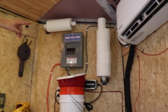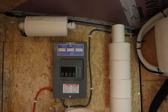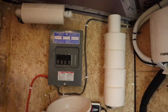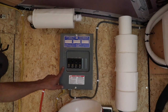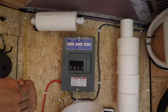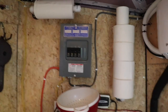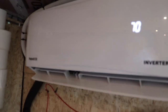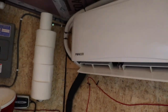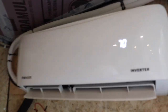Here's my panel box. This is actually set up for two 40-amp, two-phase inputs — it's a residential panel. All I did was put a jumper in, so it's just single-phase, one leg. And you can see this thing's cooling — I have it set to 70 degrees and it's currently 64 degrees in here. That's kind of the heart of the whole operation.